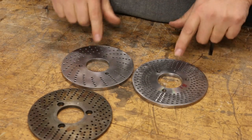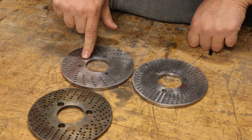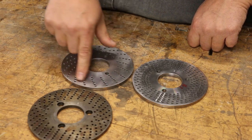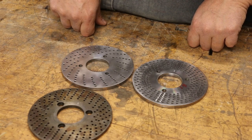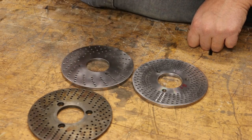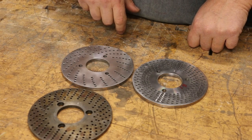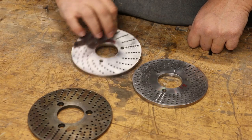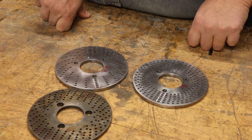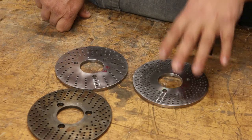It's not a huge deal — we haven't lost all the work. All I've got to do is drill three new holes on the proper diameter. It really does not matter where these mounting holes are in relation to the index holes. So we'll go ahead and drill three more holes on the right diameter, and you guys will get to see me do it manually — so we can actually talk about how we would drill out these hole patterns manually. Of course, it'll only be three holes versus — this plate goes from 15 to 20 holes, this plate goes from 37 to 49 holes, and some of the plates that Mike is doing have over a hundred holes in the circle.